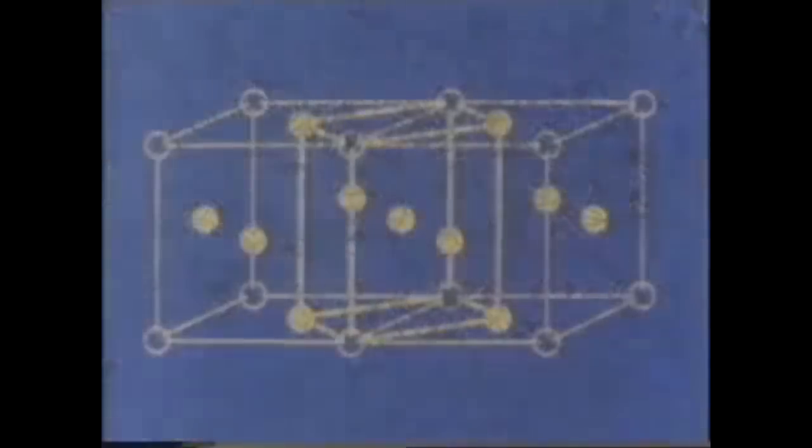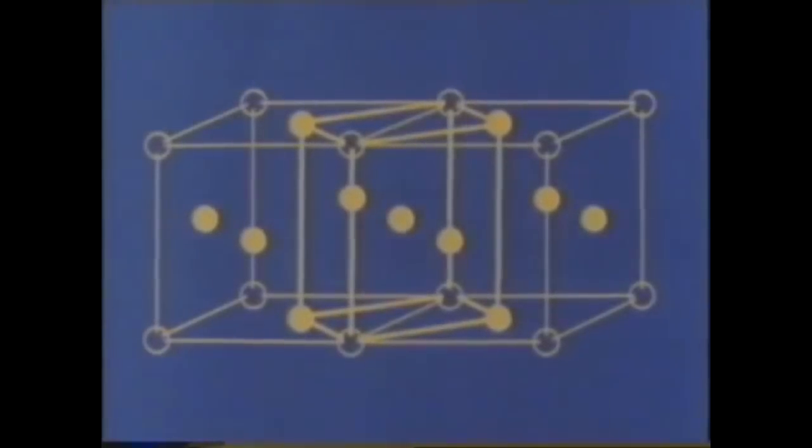Under the microscope, it looks like this, with its characteristic needle-shaped crystals. In practice, few steels are used in this extremely hard and brittle martensitic condition, and the reheating of the rod again to a lower temperature, tempering, removes some of the brittleness, yet retains much of the hardness. What's happened in the tempering process is that a small amount of carbon from the distorted arrangement has been allowed to come out of the solid solution.